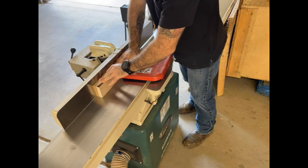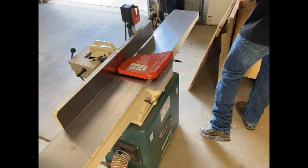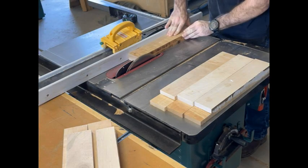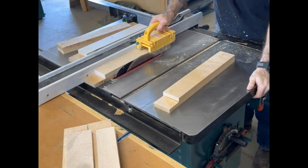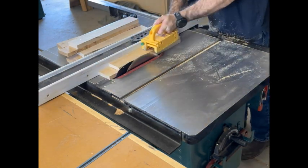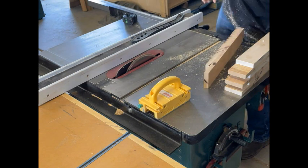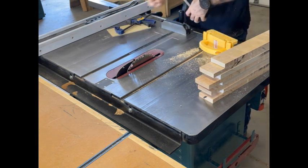After the lamination the face was already nice and square, so I'm just cleaning up the edges here so I can take it over to the table saw and trim it to final length. And since I didn't have enough quilted maple — because my wife did like the wood and wanted to use it for something else — I ended up using some regular hard maple for the back legs. No one's really going to see those. There's not a lot of light that hits this bench, so it's going to blend in there. Now you see me trimming it up to final width, then setting up to trim to final length.